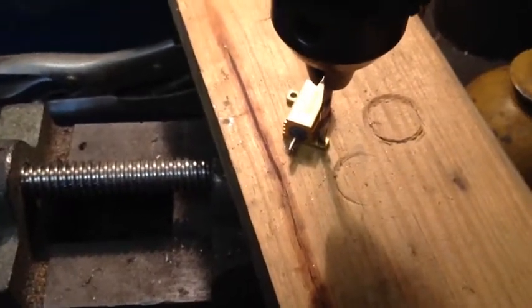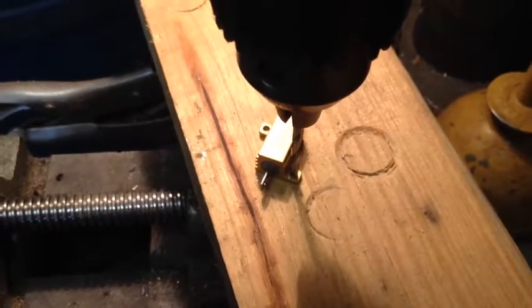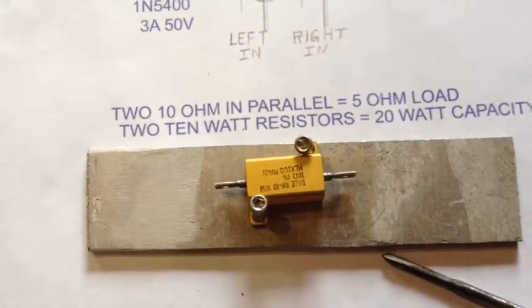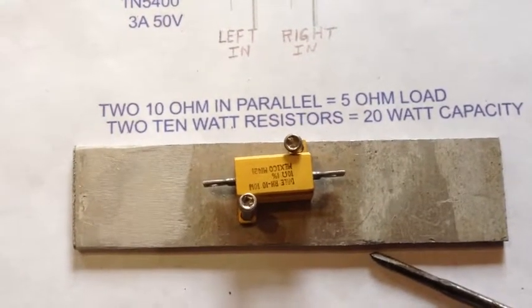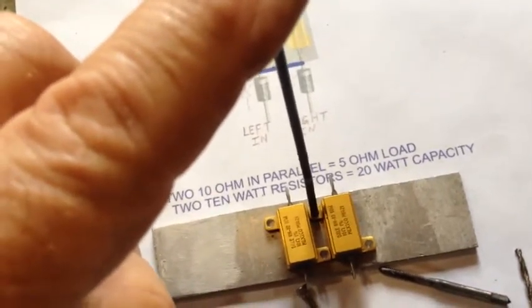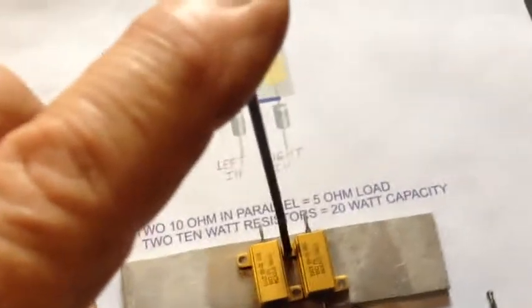In this operation I want to open up the two legs on this resistor heat sink, and I will transfer-punch these holes to a piece of scrap aluminum. You can use whatever type of material you want to mount them to — plastic, whatever, it doesn't really matter. The heat sink hole was actually drilled with a number 32; the number 43 is the tap size. I'll use transfer punches to mark the hole positions on the scrap aluminum, then drill them out with the number 43 drill for the 4-40 screw.